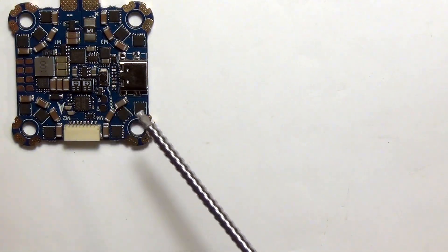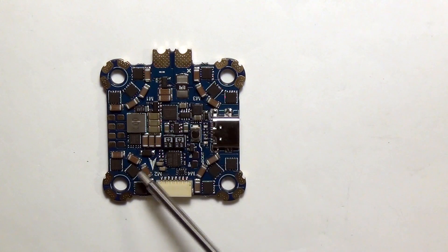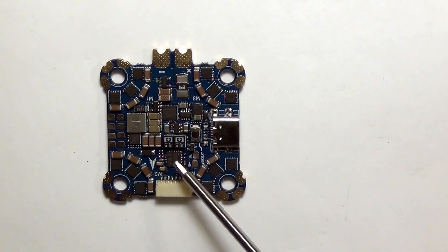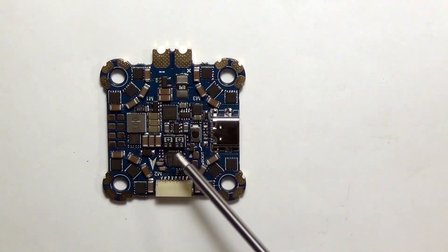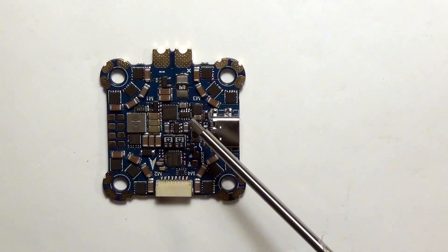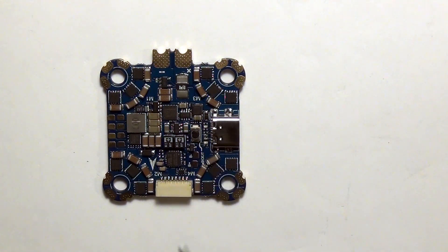As you can see from the spectrum graphs on screen, all around this is a good choice. The obvious downside with an all-in-one is that if anything goes — like I had two ESCs blow because they got snow in them — obviously the whole board's trash. This board is about $60, so it's not really that bad of a value. You're getting a flight controller and 4-in-1 ESC, 40-amp, 50-volt peak, BL-Heli 32, MPU 6000 gyro — it really has everything packed in with all the different connector types. The only thing it's missing that you've got to be aware of is the analog OSD.